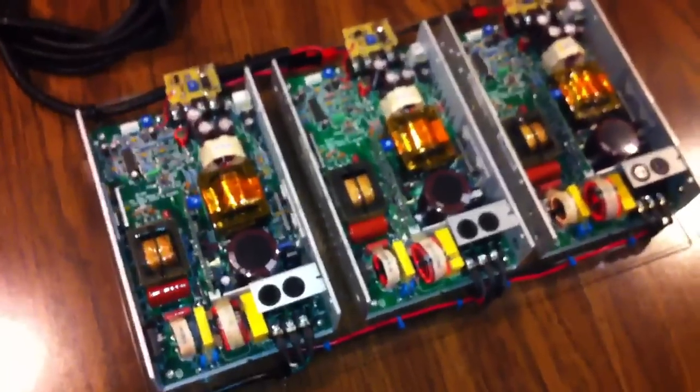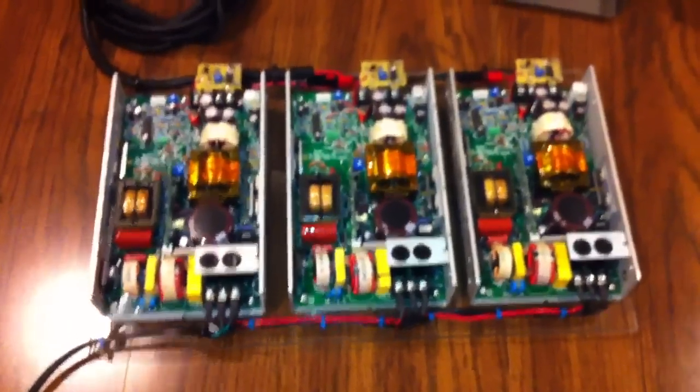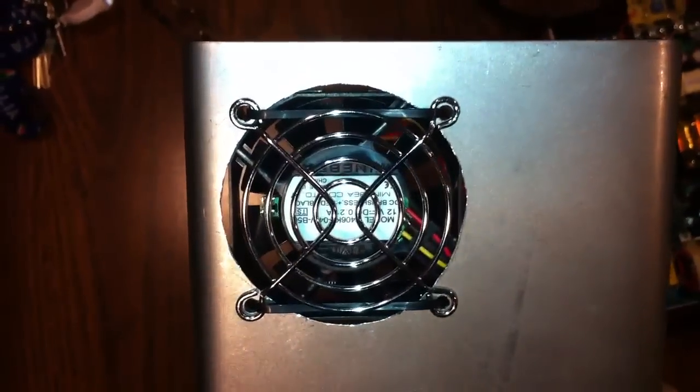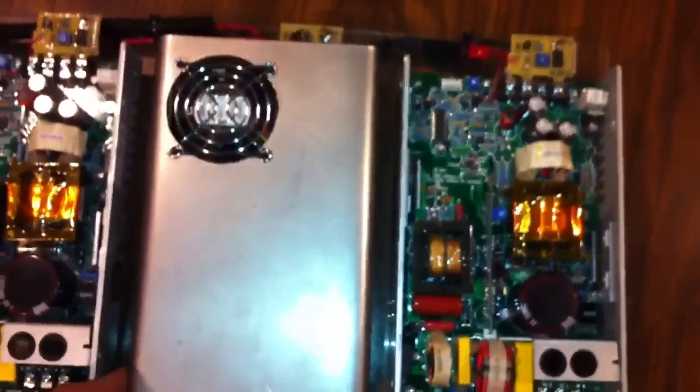These supplies you could purchase the cover from the manufacturer; however, I pretty much found it impossible to find, so I just made my own. It's just a piece of metal, probably about a millimeter thin. I drilled a hole in it, added a little fan in there with a metal shroud, and some zip ties to hold it all together. Basically you could just plug it in, and it should look something like that. I've got one more to do, but two cases are done.